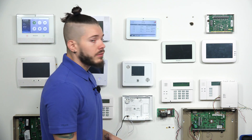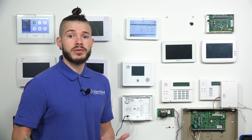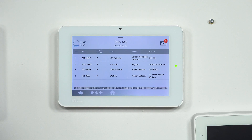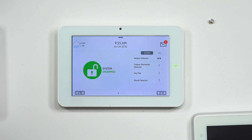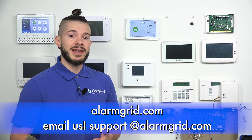And you have now programmed in multiple PowerG devices, all by just auto-enrolling. Some only require the battery to be plugged in; others might require you to press and hold the enrollment button until the LED light stays solid, then release it. This was just a quick example of a bunch of different devices that require different enrollment processes, using the IQ2 Plus panel. Every system will be different with different instructions to get into programming. Once you're done, you can just back out to the home screen. If you guys have any questions regarding this video, please feel free to email us at support@alarmgrid.com. If you found this video helpful, please like, subscribe, and hit the little bell icon to enable notifications. Thank you very much.